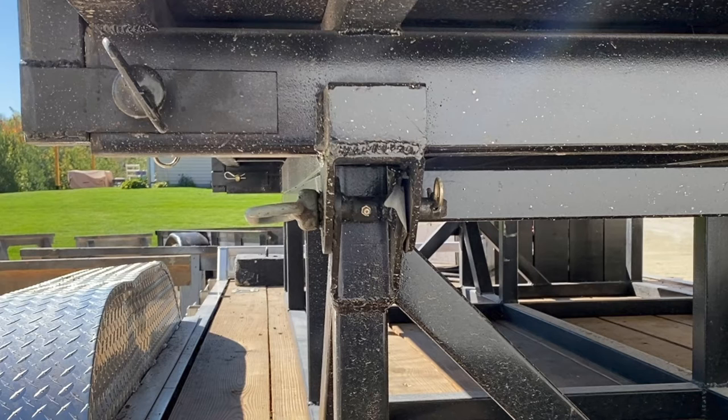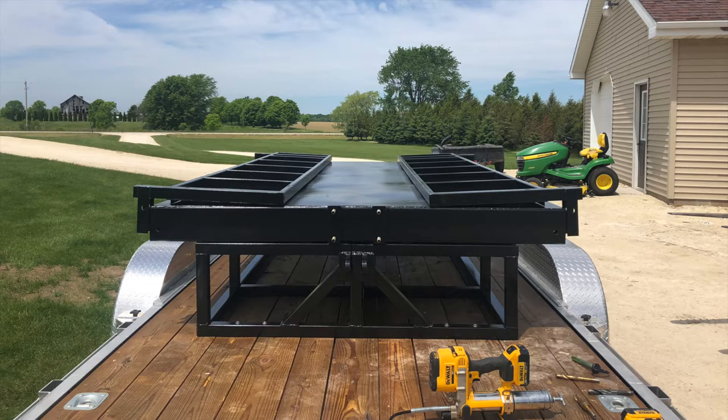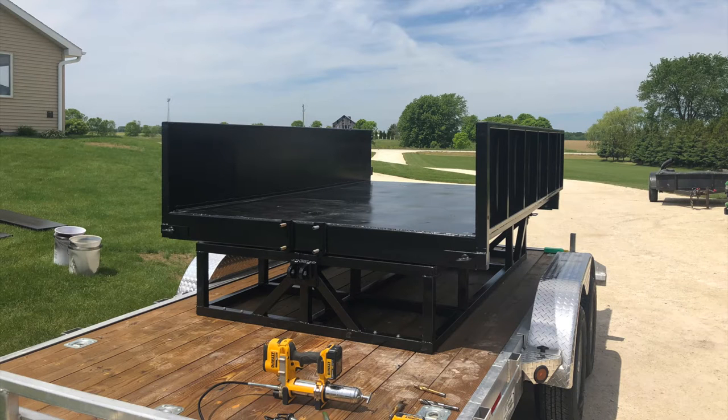On the top left you can get a look at what the sides look like. The sides are separate from the trailer for a couple of reasons. First, I could not find a way to make them strong enough to haul around 12,000 pounds of gravel without making the whole thing so heavy it would be hard to lift with the tractor forks. Also, sometimes you just want a flatbed, and having that capability is nice. So the sides are made out of 2-inch by 2-inch tube steel.